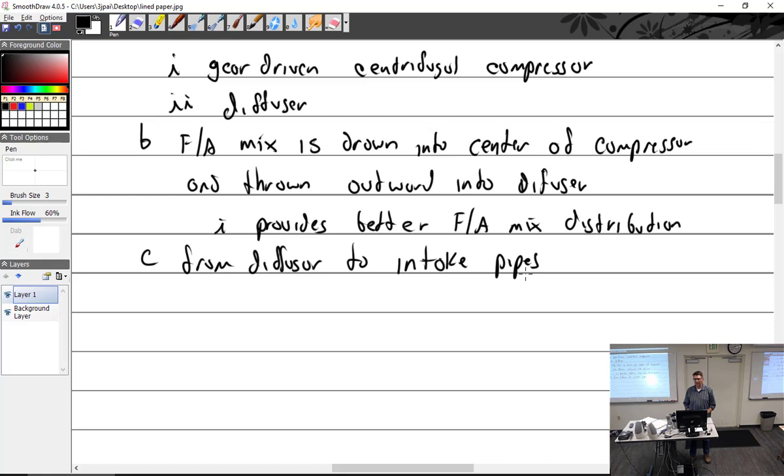Yeah. Okay. And we could talk about the Allison V12s. Not that I've ever worked on one of those, but I've seen the drawings, and it has the big PR58 pressure carburetor that bolts on the back of the engine and goes into the engine. The next thing it hits is the supercharger. So of all the aircraft that I'm aware of using the internal supercharger, it is going to be a fuel-air mixture off a pressure carburetor going into it.